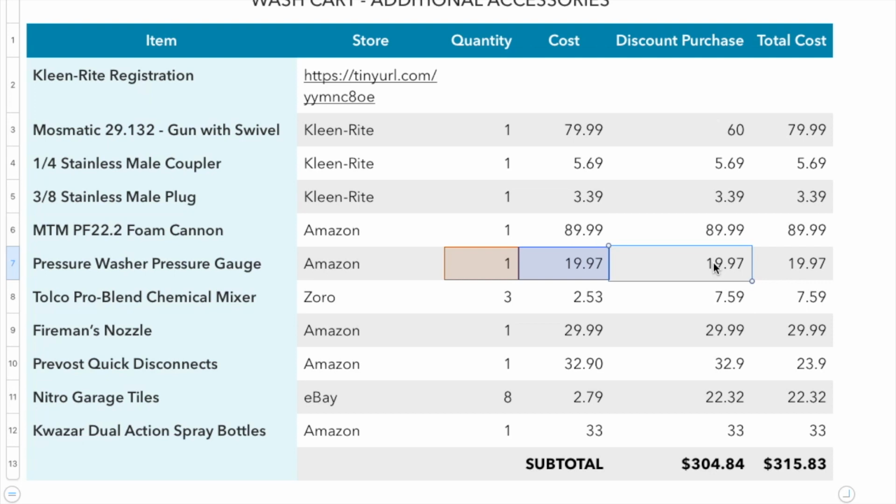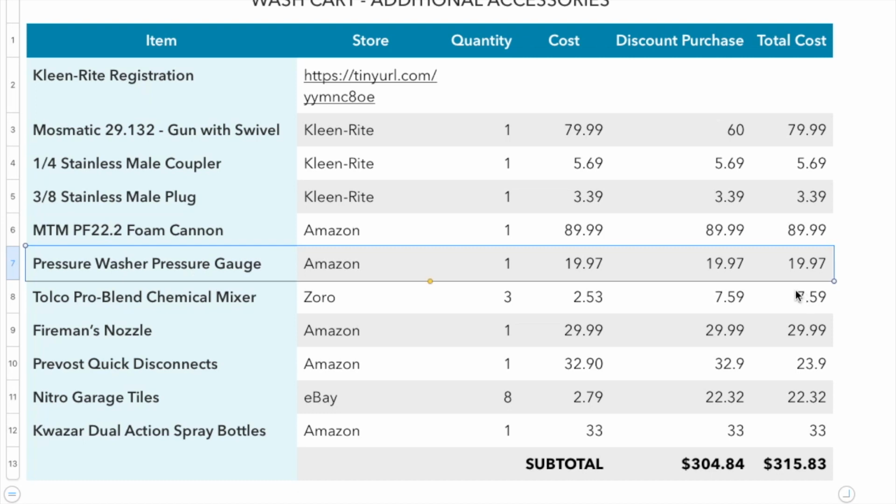The pressure gauge that I have is good to use if you want to reference my other videos that I plan to make for the pressure switch. If you can't attach your pressure switch at the unloader, you'll have to figure out the pressurization between when the trigger is pulled and when it's in bypass mode at the hose. Or if you just want to know what your output pressure is when you adjust the unloader or when you're using things. For $20, it's not bad. It's kind of nice to have. It's a good tool. I've definitely used it testing different things, and for $20, I'm happy with it. You can also use it to splice in your pressure switch. I know normally just the coupler itself is around $10, so it's a nice tool to have.